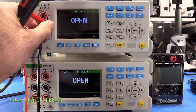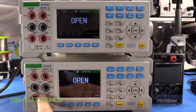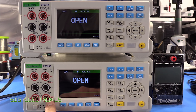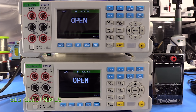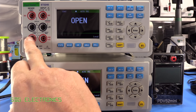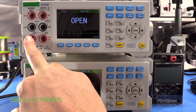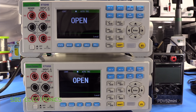One thing I've noticed is it has a slightly odd configuration for current measurement. You can only use the first jack for up to 100 milliamps, which is going to catch you out almost certainly. They do provide about 400 milliamp fuses in the bag. The other jack is 12 amps, so you're most likely to just want to stick it in there so you don't accidentally keep blowing the 100 milliamp fuse.